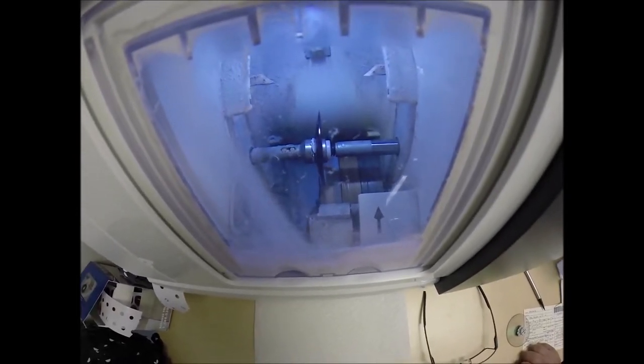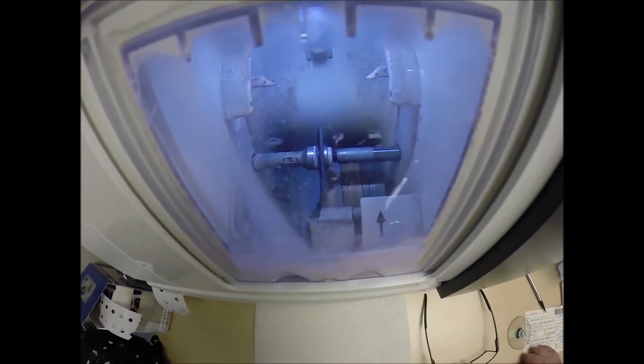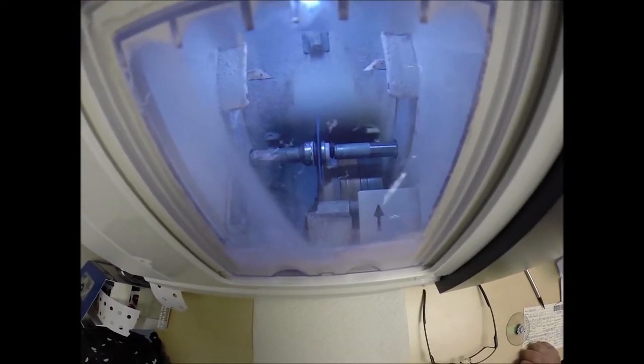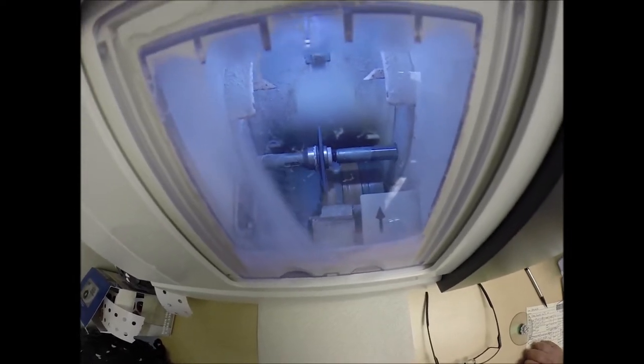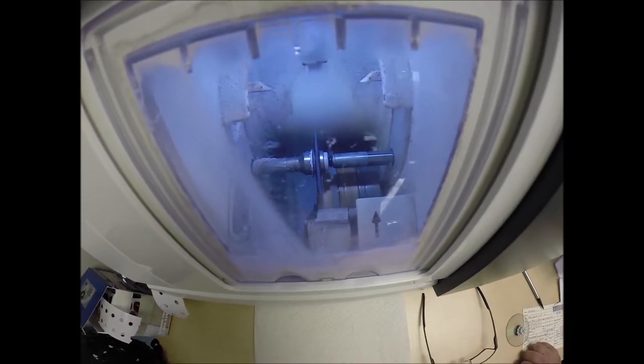But polycarbonate lenses cut dry, whereas plastic, high-index plastic, and Trivex cut wet, meaning that water sprays onto the lens for the duration of the cutting cycle. Now, water will spray on the polycarbonate, but only for the last 20 seconds. Polycarbonate cuts dry, so no water is spraying on it.